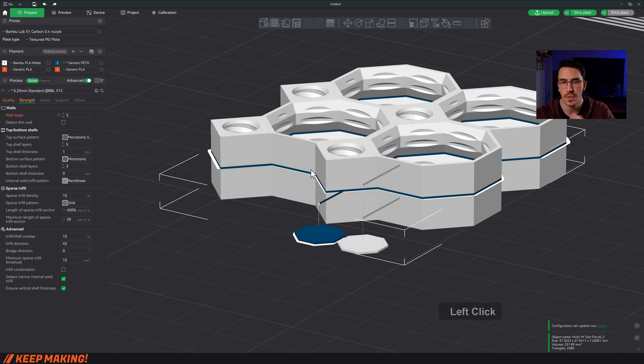Here's why we change the flow rate: PLA prints first, then PETG gets laid right on top. PLA and PETG are literally like water and oil — they do not want to stick to one another. So we over-extrude the PETG at 1.1 so it bulges out slightly and grips the bottom PLA stack just a tiny little bit, and that makes all the difference. I had countless failures before doing this. You may need to go up to 1.3, but I find that creates too marred a surface; you might also need to go as low as 1.0. Test it with the test file.